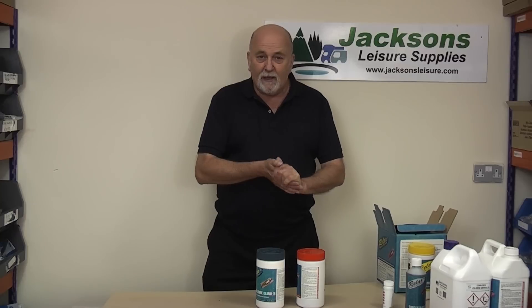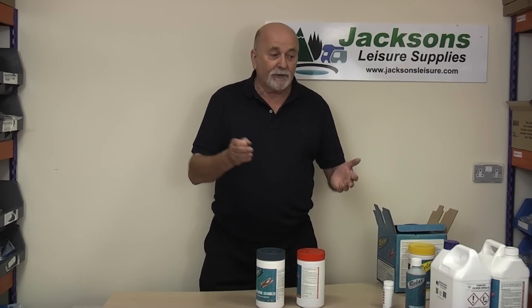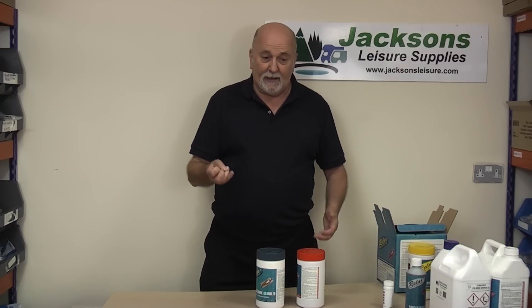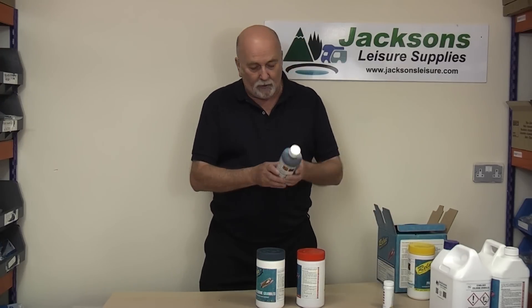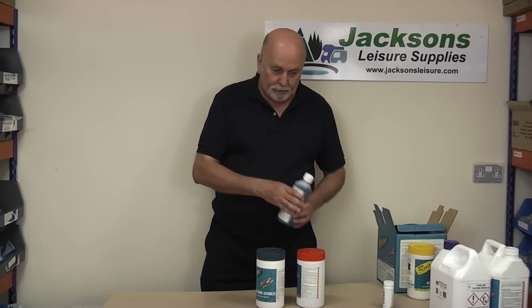If you keep on top of those things — the chemicals and the filter pump — you should find that your water will stay crystal clear. The ultimate goal is crystal clear water in your pool; if you're doing everything right, that's the result you'll get. Some chemical starter kits also come with algicide. If the pool goes green, you can put algicide in to kill it off.